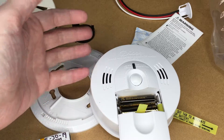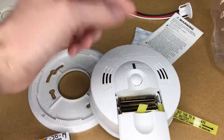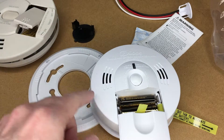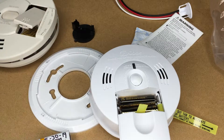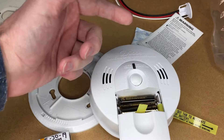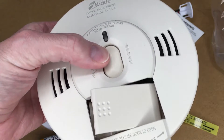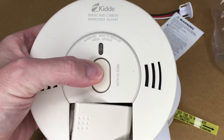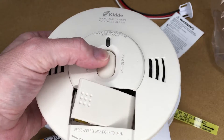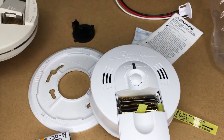I was reading a review that if you have a problem with the sealed-battery version and need to take it off, it's unclear how easy it is to deactivate — you might have to throw it in a bucket of water or something to make it stop. With this one you can just pop the batteries out, which is handy if you have a nuisance alarm. If you have a detector with americium in it, you need to treat it as hazardous material and drop it off at a hazardous waste site. These ones I'll just recycle at my electronics recycler.